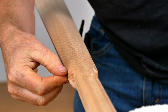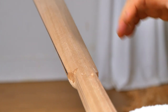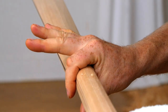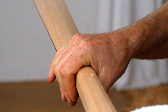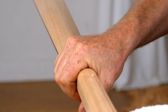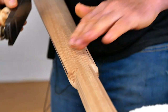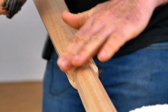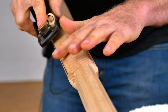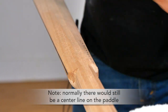Having this be a fairly sharp point right here is actually a really important part of your hand grip. The way you're going to be holding this paddle is to put your thumb and forefinger around the paddle, and these three fingers are going to index over that ridge — so if that ridge is a little bit pointy it actually helps to stabilize the paddle. Make sure you're taking at least moderately long swipes to blend this into the rest of the paddle, and blend it over the top without reducing the vertical height of the paddle in this area.